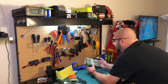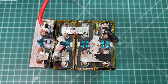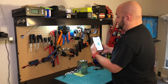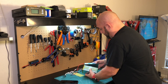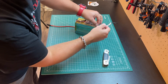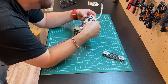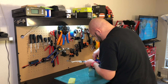Nothing about these cells looks or feels new - you get that feeling of just old electronics. There's a QR code on here; scanning it provided zero results on Google, just the lot numbers on the cells. None of the lot numbers are the same, so there are definitely mixed batches here. They put so much silicone on these - I could probably use that BMS for something. I don't think the BMS is bad; I think the cells are bad.